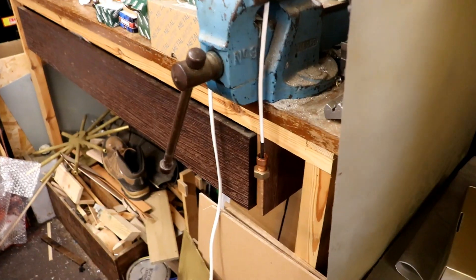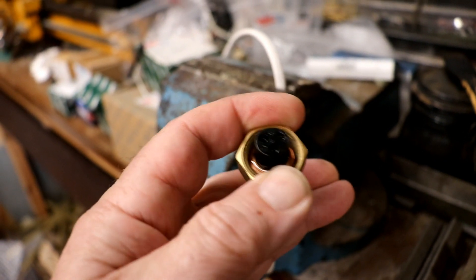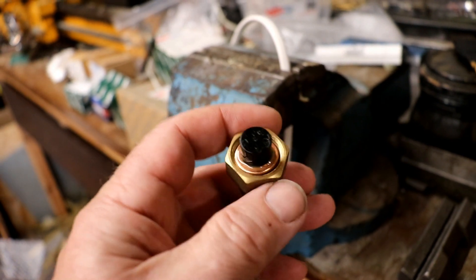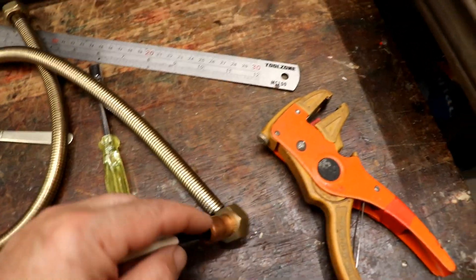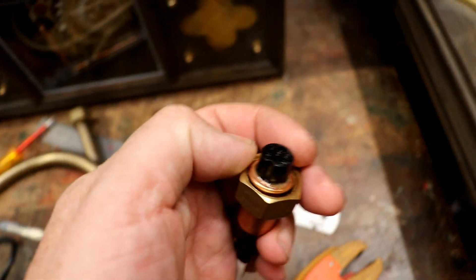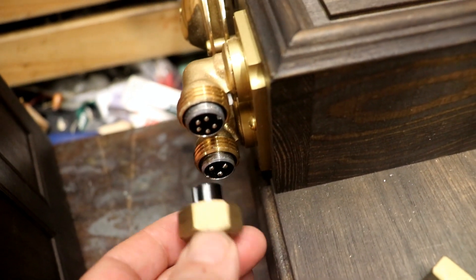The other end has been sitting overnight. There it is — look — we have the other end, the plug socket thing. I've glued it into a 15mm — I think it's a half inch in this country — a tap connector. Plumbing again. And that just fits perfectly. With one piece of 15mm pipe glued inside that, the end of the shower hose just pushes inside and can be glued with super glue — it's perfect. The great thing about gluing this onto one of these half inch pipe fittings is that these are 15mm brass elbows. The other side of the plug socket thing, if you turn it down such a small amount, can be glued in there, and then the two fix together — you can tighten them as well. Bob's your proverbial aunt. Fantastic.